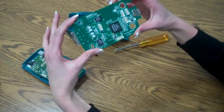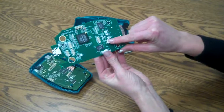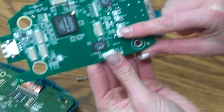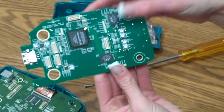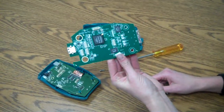Once you're looking at it, you can see right here is where we're going to be changing the capacitor C606. Right here. Once you've changed that to 100 nF, 0402 case size, we're able to assemble the boards back together.